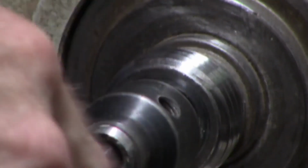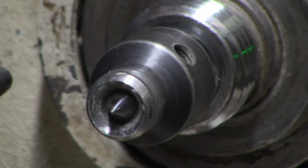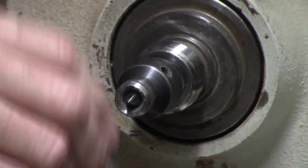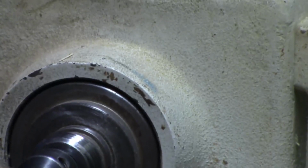Well, you can sharpen this rim with a file, a fine cut mill file, because you want that sharp. You want to drive that into the wood. But to have it drive in woods like Osage orange, hard maple, cocobolo, I take a chainsaw file and I cut 3 little notches. Turns out 3's enough. And it'll drive any of those woods. No problem.